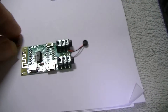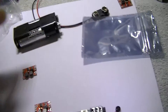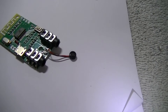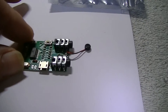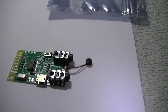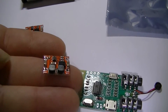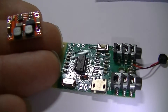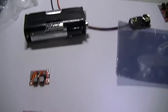These will run down to about 2.8 volts and then they power down. But with this DC-to-DC boost converter you can get the battery drained down to about 2.1 volts — so they'll be completely flat by then. Should we build it?